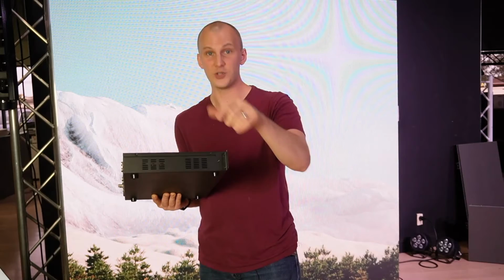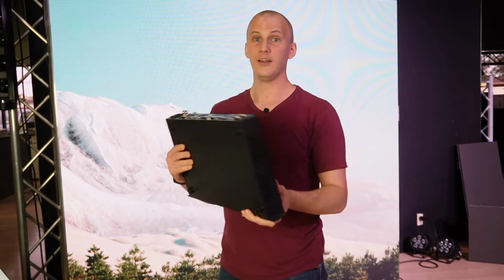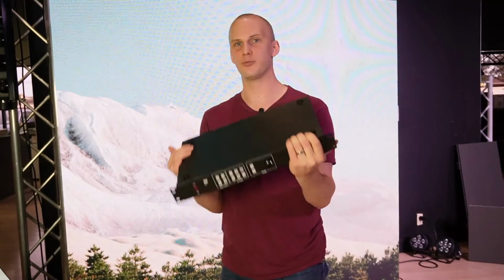So to answer that question, you don't always need a video switcher if you're just doing multiple sources to a processor like this. Having a video switcher, of course, if you're switching between cameras and other sources and whatnot, may make sense in the whole scope of your rig, but you don't necessarily need a video switcher for a video wall. You can go straight from a computer, HDMI, straight into the wall. A lot of these processors, including the Gamma ones that we've got here, have USB. So you can plug in a drive with a video file and let it play if it's more of a stationary setup. Okay, let's talk about other parts you might run into.